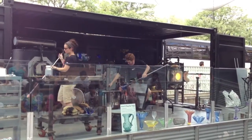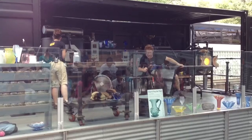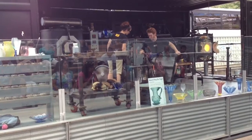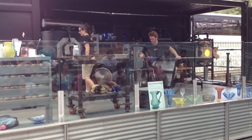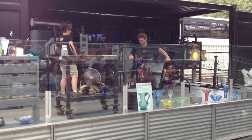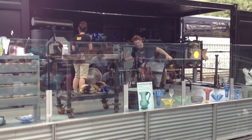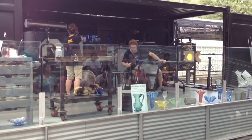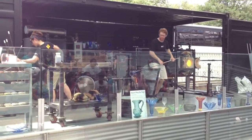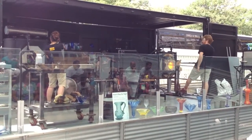He applies that glass, it is still sort of flowing, so it moves over the bottom of the form. You may have noticed he was turning as he was applying it to the piece, and that was to help keep things on center. He reaches up and uses a tool called a crimp to create a texture all the way around on the foot of the piece. The crimp tool has sort of a lined texture on the inside of the small paddles. And that cold metal will freeze the glass into place. We can have that little texture on the bottom of the foot.